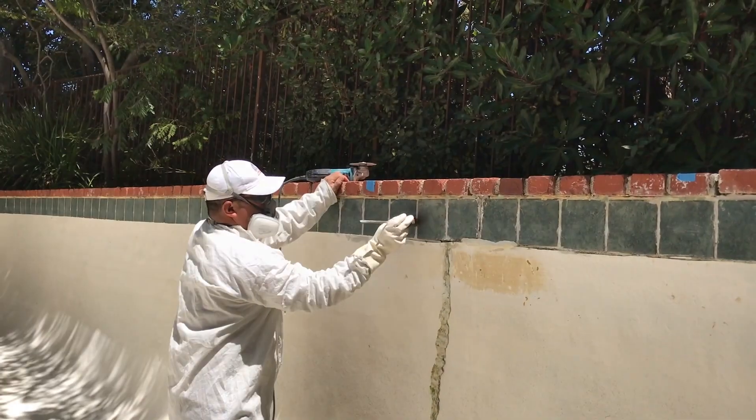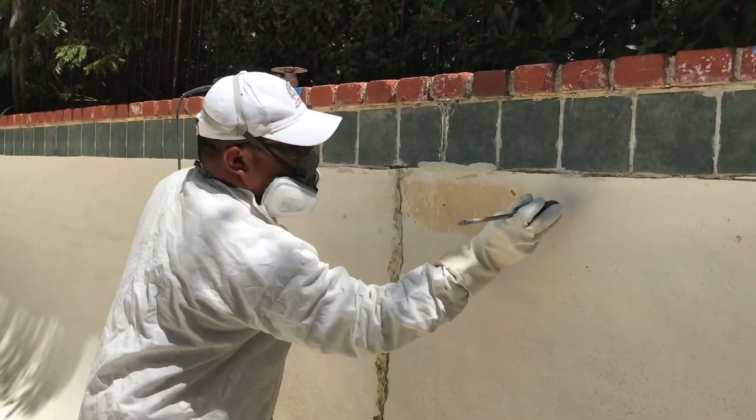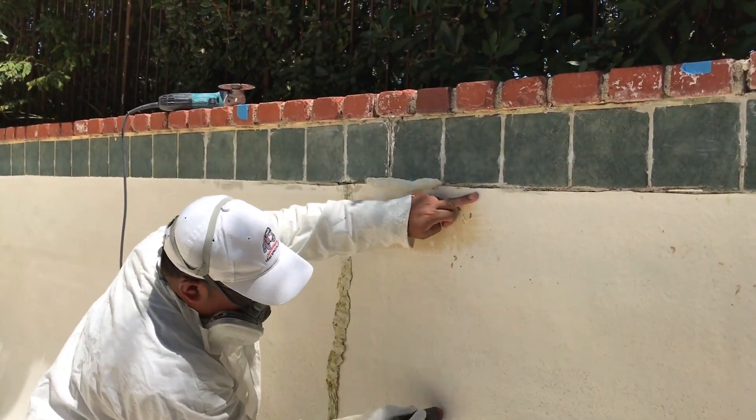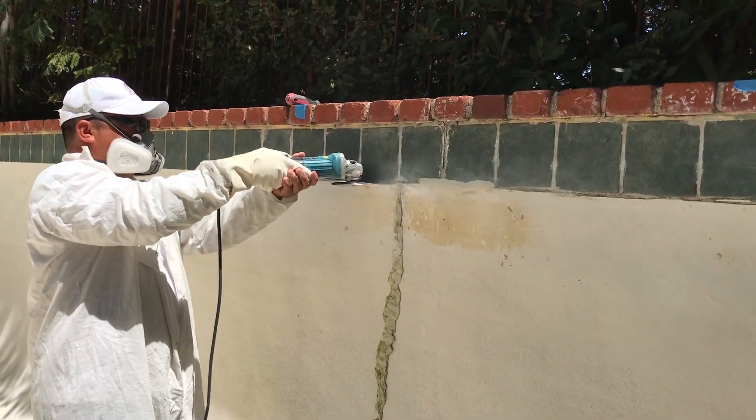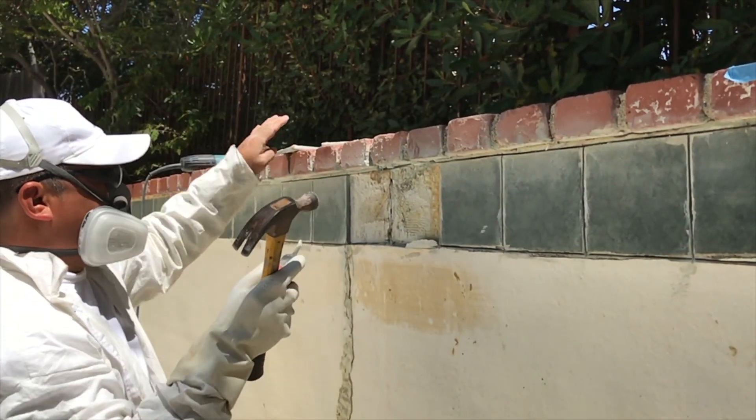This was all fiberglass — you can see how it's a little faded from the sun. So we're tapping it out, listening for hollow spots. Once we find them, we know what area we have to cut out. We had some loose material behind these tiles as they sounded hollow.